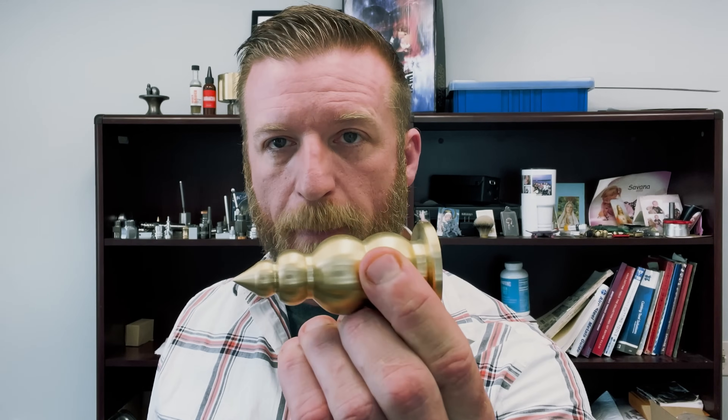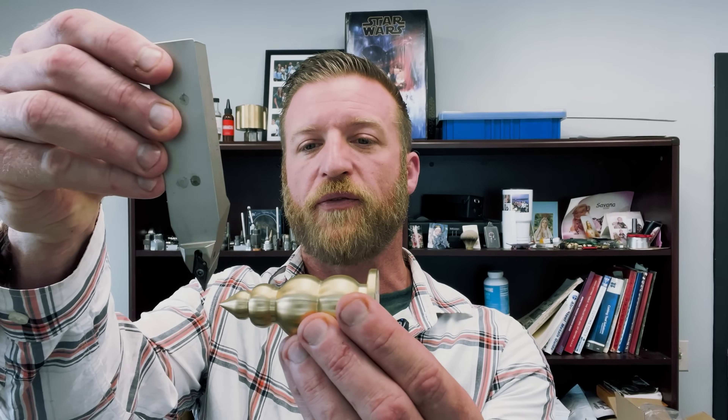We talked about rough turn and finish turn. This last section covers a special insert — a different tool for clearance that a WNMG or CNMG wouldn't work for. Furthermore, there are applications like brass where you don't necessarily need a separate rough and finish turn, unless your tolerances or surface finish are super critical. Something like this would work fine — you could rough it all out and then profile it with the same tool because it's brass.